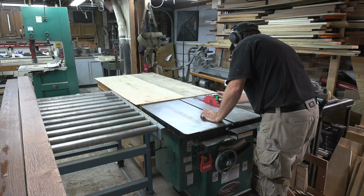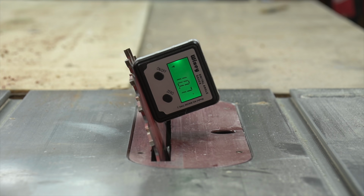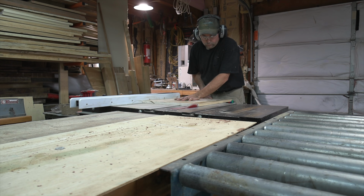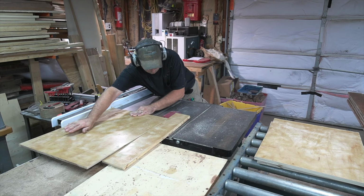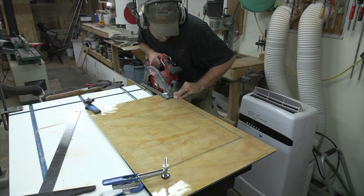So with a few unusually warm days in November that would be good for epoxy work, I decided to take a break from planking and move into the engine room to make these changes. I used some door skin material to create templates so I could cut the panels that we made up previously to fit perfectly. And then it was just a matter of using a traditional 5-to-1 epoxy from Total Boat and some Thixo pre-thickened epoxy to install them. And as time and temperature permits, we'll move on to the other panels doing the same process.